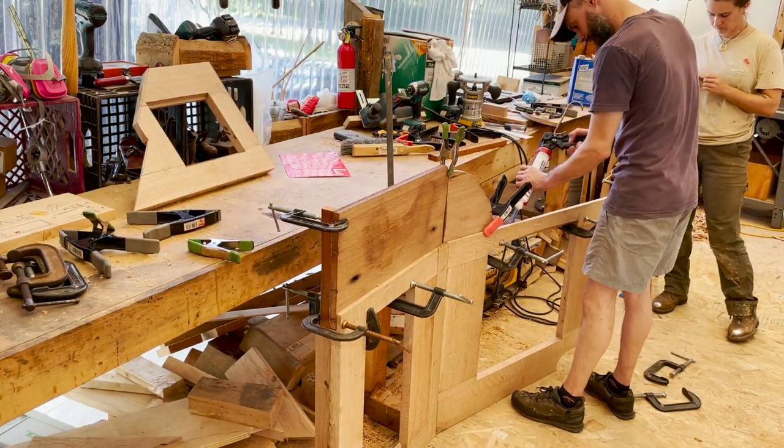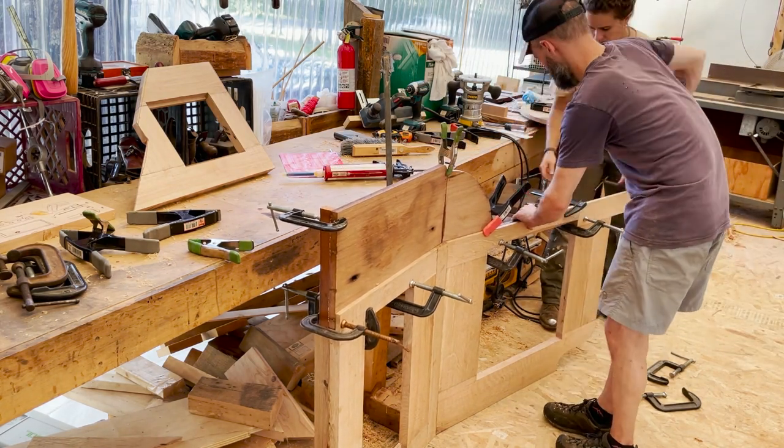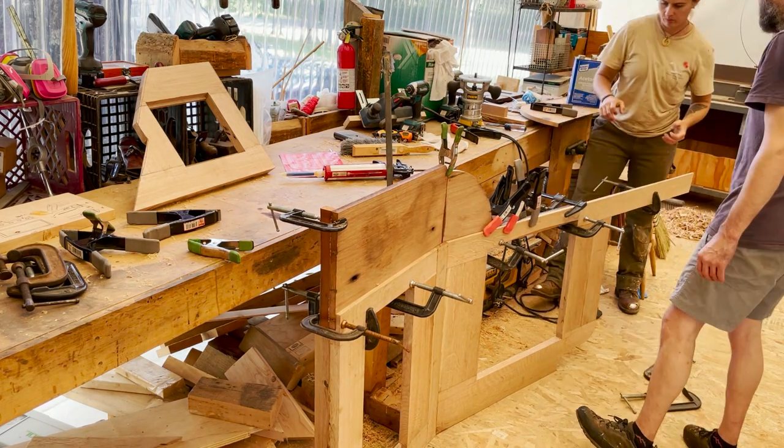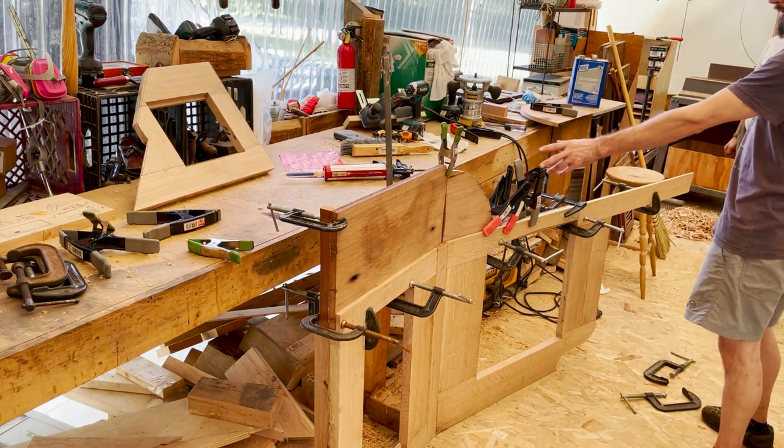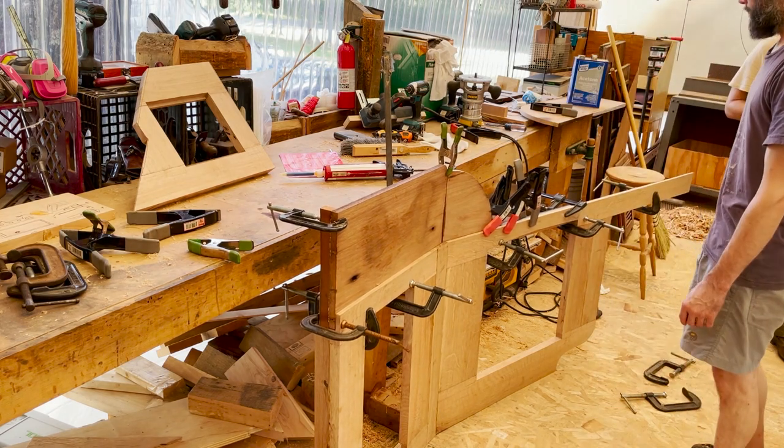I think that's it. So that's the support rail in the back that'll carry the slats for the bunk. Nice. I'll screw fasten that later. Nice. But the glue's there. That corner joint is glued, so once these get screwed in, that should be good.